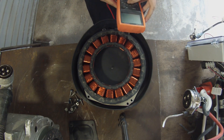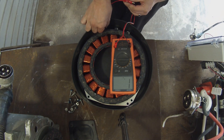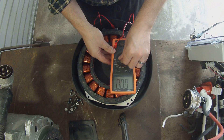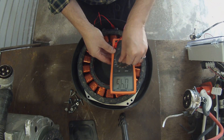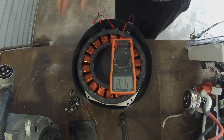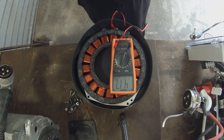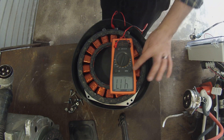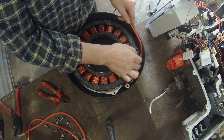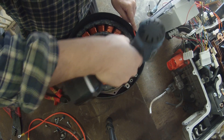I know this can be confusing — you're probably also thinking that my odds of a guest speaker invite at Weber State have just taken another horrible dive, and that's probably true. Looks like about 400 microhenries, or half a millihenry, is our inductance, at least at one kilohertz according to my cheap eBay meter, between our various phases. That's actually enough and I think it's gonna work. Mega prizes if anyone can guess at this point what I'm doing — apart from cross-threading bolts, of course.